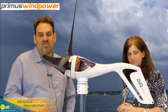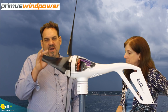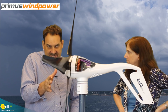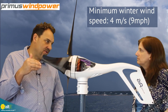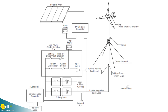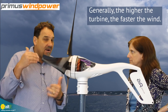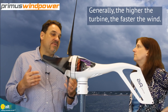We're the manufacturer of this little micro turbine here, and when you're dealing with wind you want to know your wind regime. The most important thing is your wind regime. If you have four meters per second or greater average wind speed, you're a good candidate for a hybrid system combining solar and wind together. Based on that wind speed, wind regime, and the tower height your turbine is going to be at, you need to determine what type of blade set or turbine you want.